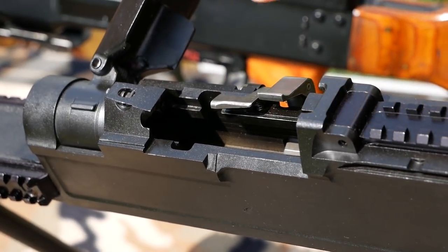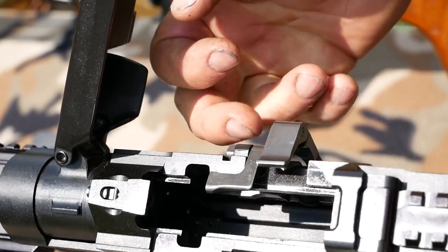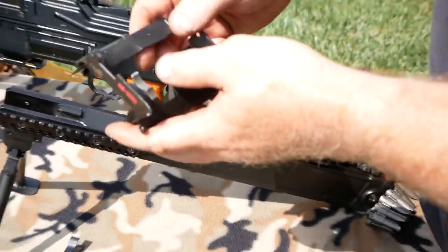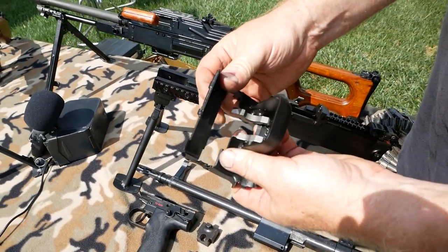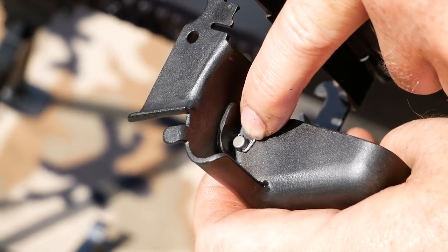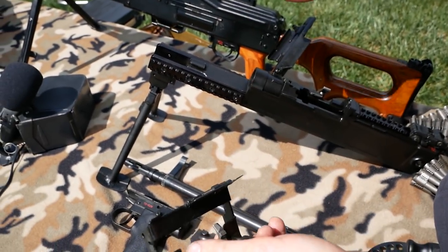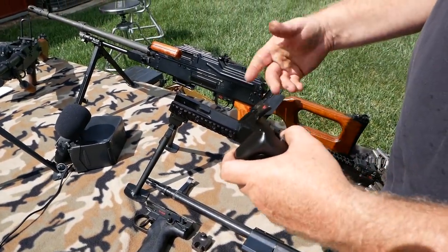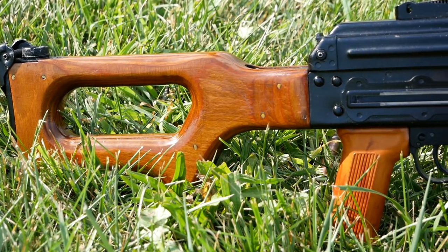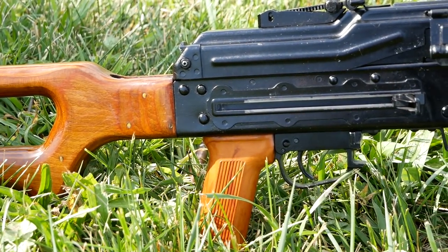All of these pawls are just like that. This is a holding pawl — a belt holding pawl — it adds tension to the belt. All you've got to do is drive that little pin out and it comes off with a spring. In your feed tray, a tensioner and a holding pawl — easily removed and maintained in the field. Drive the cotter pin out, drive it out with the spring, put your new part in, and go. Right now you can buy a complete UK-59 parts set for somewhere south of a thousand dollars — you can buy six complete parts sets or more versus the price of one PK parts set, and you'd have enough parts to maintain this gun for generations to come.